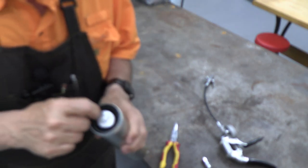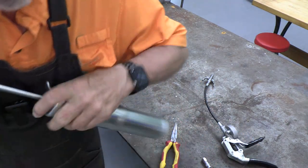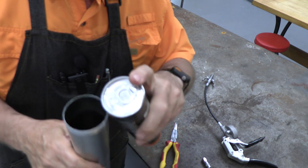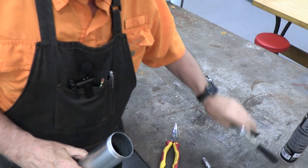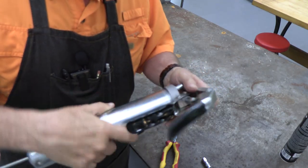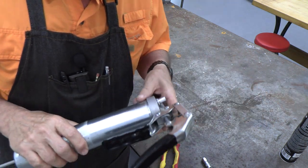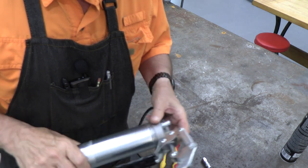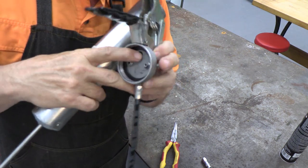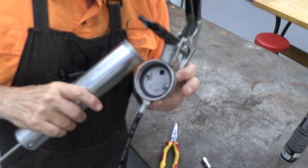When we charge it and release it, it's great. The next step is to put a new cylinder of grease in here. After you fully extend this, the new grease cylinder will literally just drop in here — flip open the can and put it back together. But when you put it back together, don't have it fully tight. When you release the lever you need a little gap so the air trapped underneath the top of the grease cylinder can escape and not give us an airlock, because this is where the grease needs to go so our plunger can drive that grease out through the grease fitting.